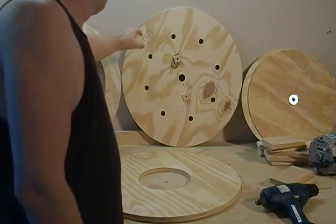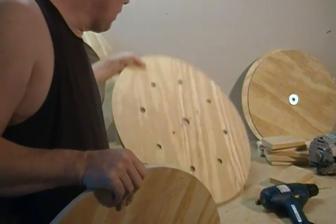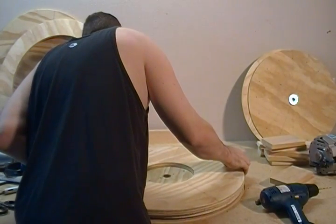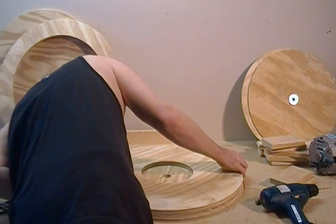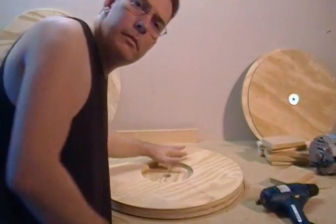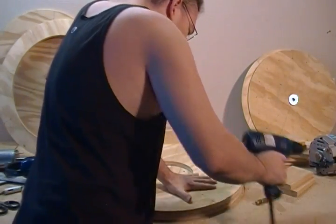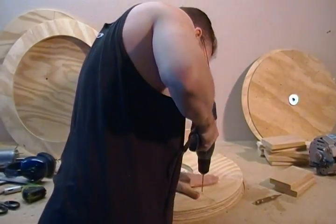Now while we have this, and we've already drilled all these, we're going to take our generator mounting ring and just line it up — line the lines back up preferably. We're just going to transfer those holes. The reason we're going to transfer them is because, in case you didn't lay that out real accurately, we want these holes to line up top and bottom. So line it up visually and go ahead and drill through it to the other end.